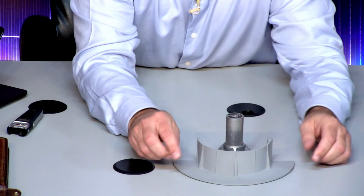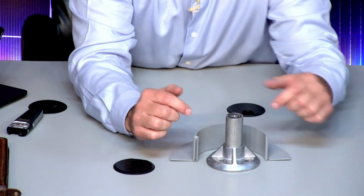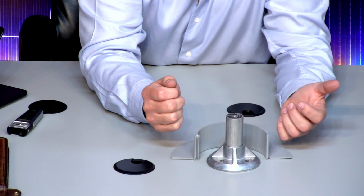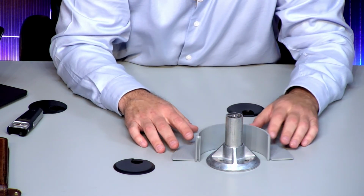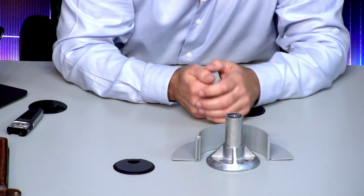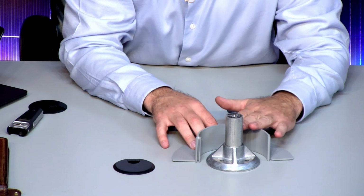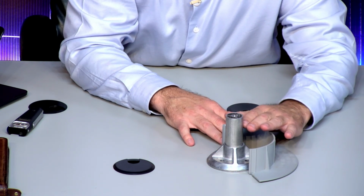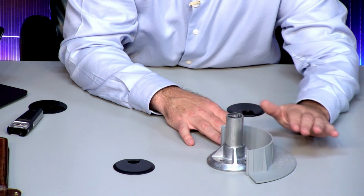You flip this over, you set this like this, and I'll show you the other side now. This is the part you need to see. When we have this mounted, this is secure now. So you are actually mounted to a rolled roof. This is a flat roof. This is not going anywhere, right? So now we put two of these together, and then there's an epoxy we fill this with. It will fill it up to the top of this, so it's actually level with the epoxy. The water does not ever get past that. So we fill this up right here with epoxy.